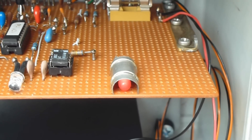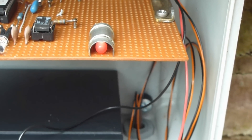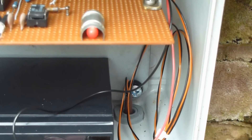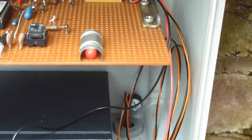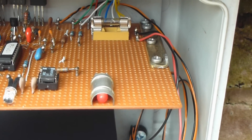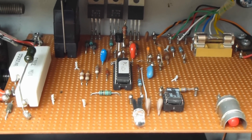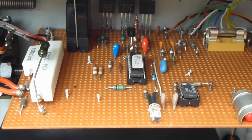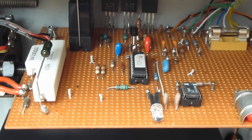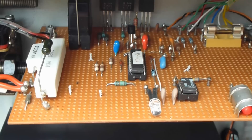Charge is supplied at a very low current at about 20 volts from a transformer in a nearby shed. That charge supply also acts as the signal for the timer. The charger in the shed is plugged into a pinwheel timer and the PIC can detect when the charge is being applied, so that feed from the shed serves two purposes: charging the battery and, in timer mode, telling it when to open and when to close.